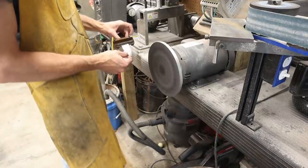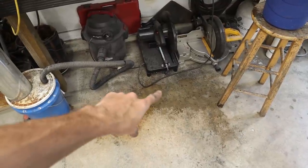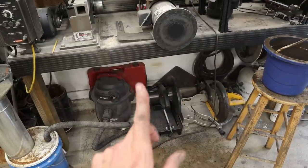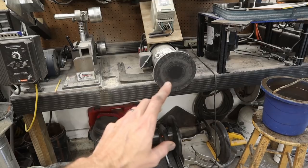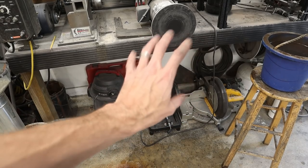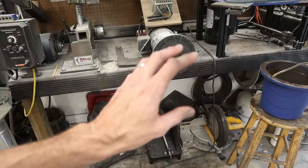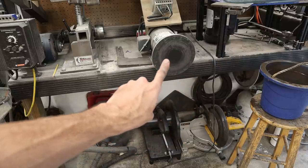That's just beautiful — that's going to make hand sanding just a breeze. I got two knives done. There's that much water on the floor because this is a disc that's spinning and flinging water off in all directions, so it's pretty imperative that you wear safety glasses. I just did two entire knives — used four sheets of paper. I consistently dip in water before I bring it back because this is effectively wet sanding. This is wet/dry paper that I'm sticking on there, and I'm keeping it really wet. It's amazing — you guys should definitely go out and get a disc sander.